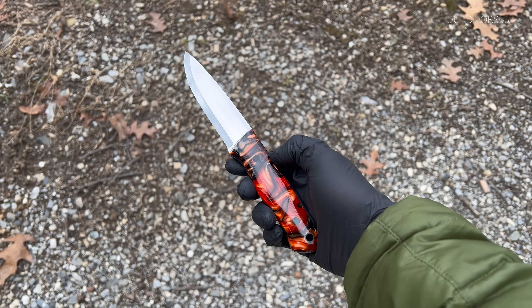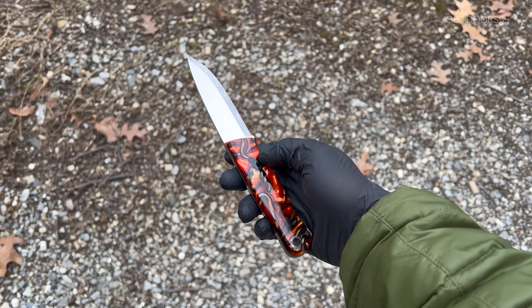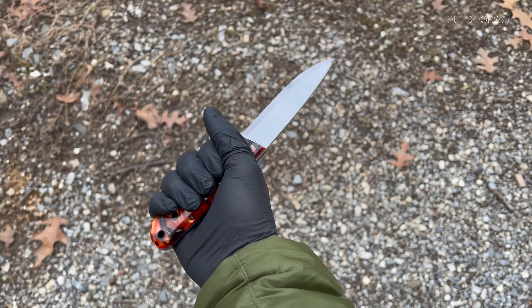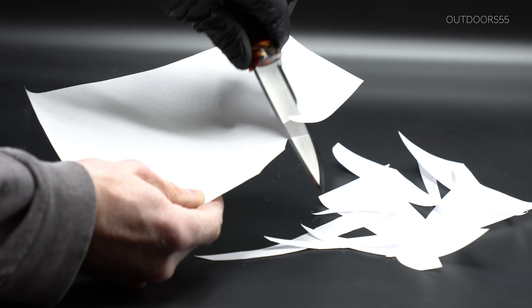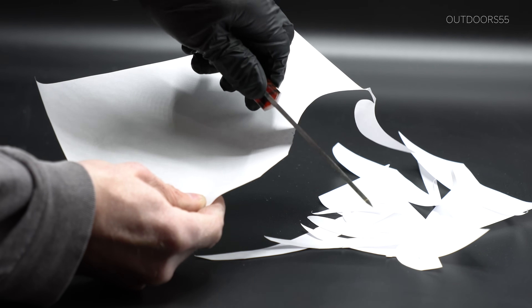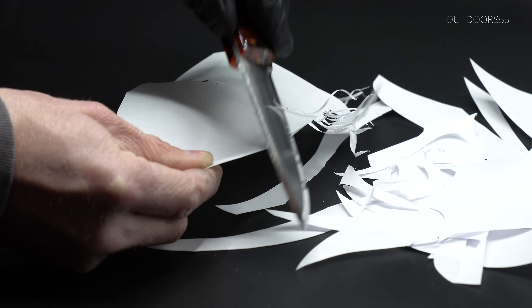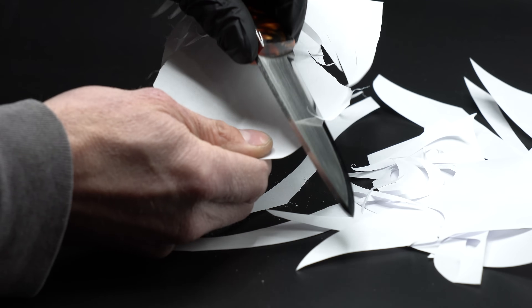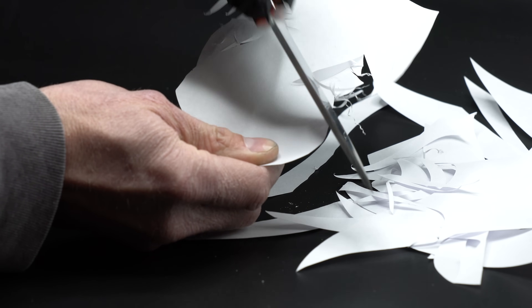So if you noticed with this build, there was very little hand work aside from the couple of minutes of hand sanding the handle. My goal is to try to streamline the production and cut out any unnecessary steps. This knife is 1084 steel at 60 HRC, 14 degrees per side, and will make an awesome carving slash bushcraft woods knife — and if taken care of, will probably last a lifetime. Hopefully this video was helpful in some way. I am currently looking into another build that will broaden my horizons in the knife making world. Thanks for watching, see you in the next video.